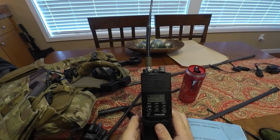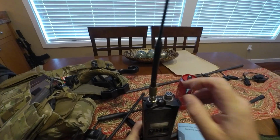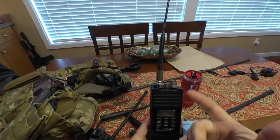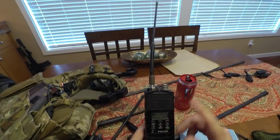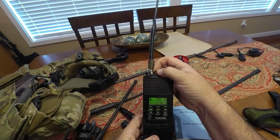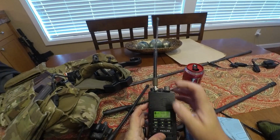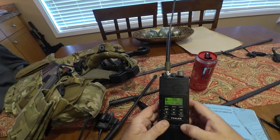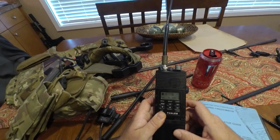Okay, where we start to get different is that this button on the top was a channel selector on the 148 and the 148 Gen 2. But on this, it is user programmable to either adjust frequency or adjust preset channel. I haven't figured out how to set it to do preset channel yet. So when I spin my channel knob, I am actually changing the frequency of the top band. This is not a transmit receive. When you normally see two frequencies side by side on a traditional radio like your 152 or whatever, that's going to be a transmit and a receive mode for duplex channels.